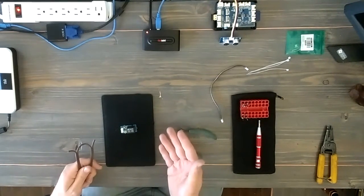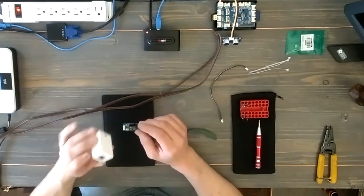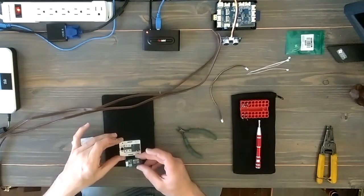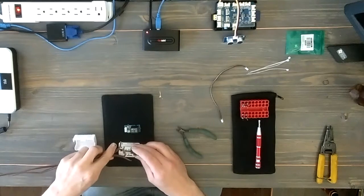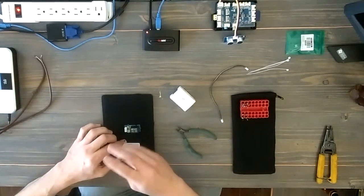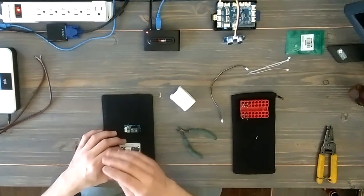The neutral's intact. We're dealing with high voltage here and we have to put this on two little small set screws. We don't want this just to be out in the open — I have a little case here. This is actually from a CAT5 junction box, and the size of the CAT5 connector and this relay are just about the same size. I want to put them in the back side and close this up so that I'll have insulation between the high voltage and the low voltage.